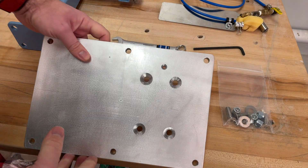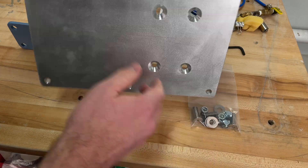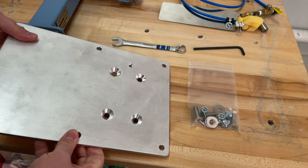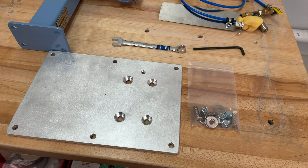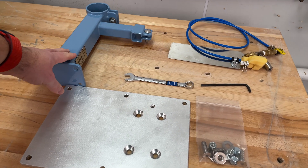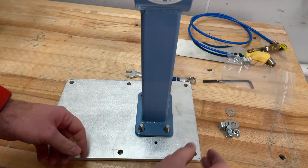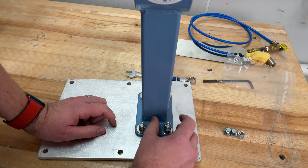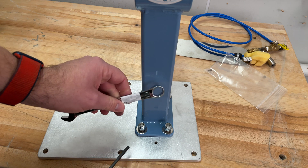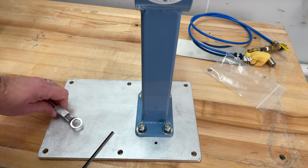The base plate is this section piece right here. You'll notice on one side you have recessed holes for your bolts; your other side will be flat. The first thing you're going to have to do is mount your stand and your water setup to your base plate. Your stand is this piece, and your water setup will be this piece. Now that you have your base and your stand hand-tightened, you're going to want to use your 9/16th wrench and your hex wrench to tighten all these down.